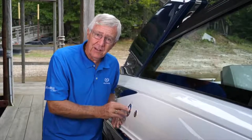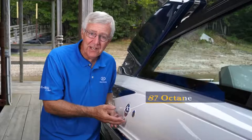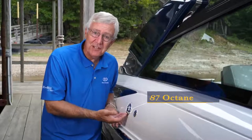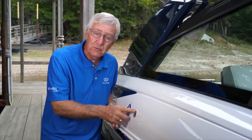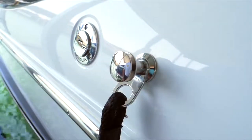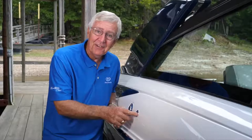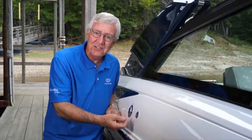The fuel tank on this boat is 189 gallons. These gas engines love 87 octane — you don't need to use high test or 89. Won't hurt a thing, but they love 87. These fittings, of which there are three on each side, are the receptacles for the fenders. That's a really nice option — this is where the fender cleat sticks in.